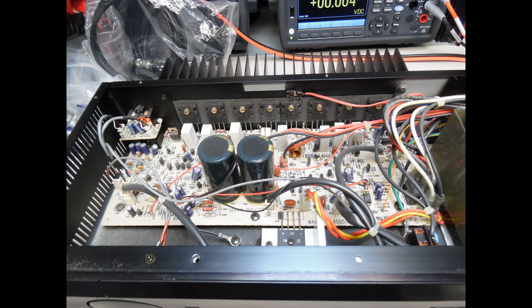At the back, just above the power output transistors, you can see the thermal device connected to monitor the overall temperature of the heat sink. There is no cooling fan — all cooling is done via the large heat sink at the rear. In a studio environment that's excellent because you don't have any noise associated with a rotating fan.